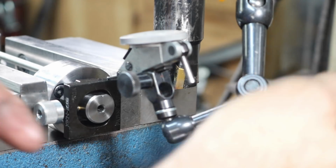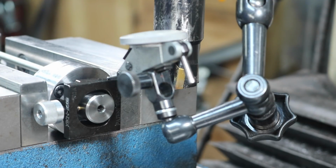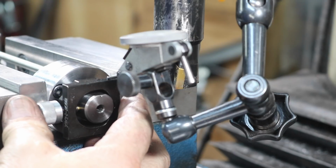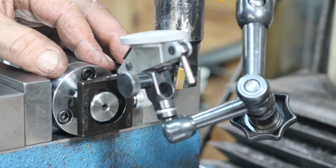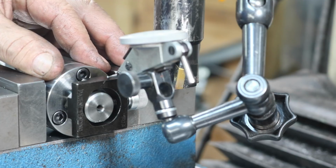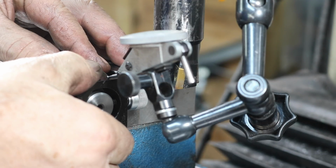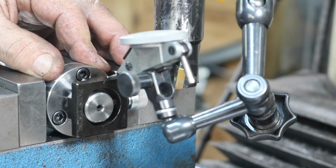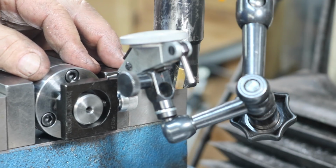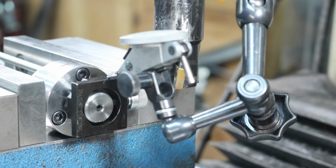We go. Pretty quick. Then we'll just roll it over, dial it in on that side, and we'll be 180 out. That's what I want first off, to get my depth right, to get my width right. There, I'm within one. That's good. Happy. Just happy. Okay. Not too bad for screwing this all up.